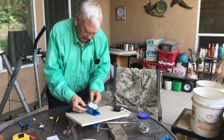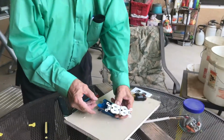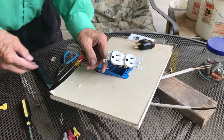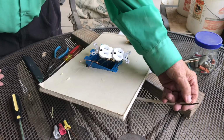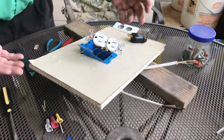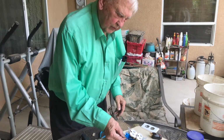Now, because it's easier to put one wire on here than two of these for the green ground, remember ground and green, and this is bare, there's never supposed to be any current through this. That's why it's not insulated like the others are, with insulation around them for the white and the black. Even in here, you can see it's just bare with paper around it. It stays like that.